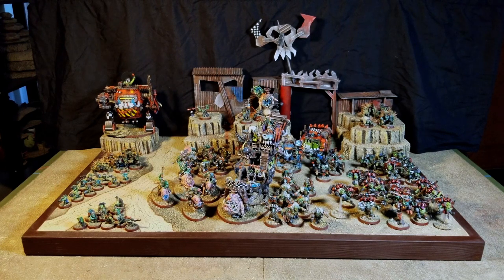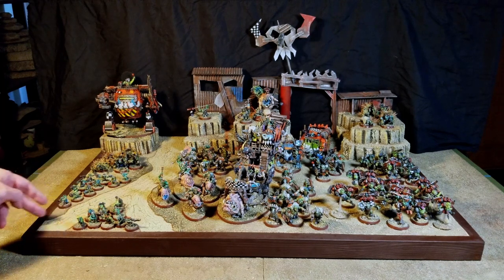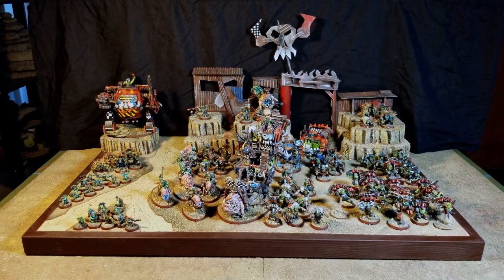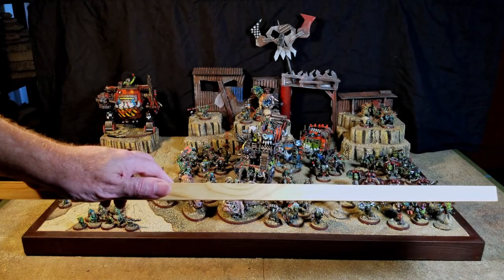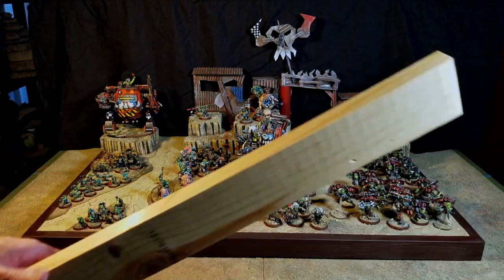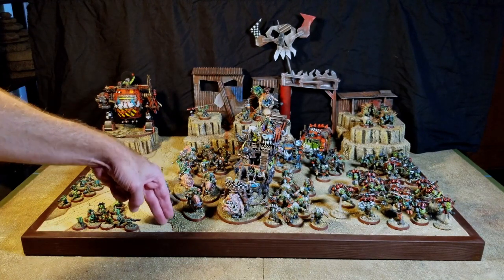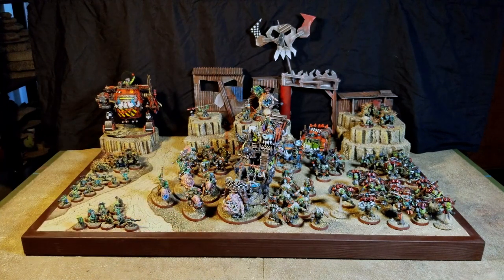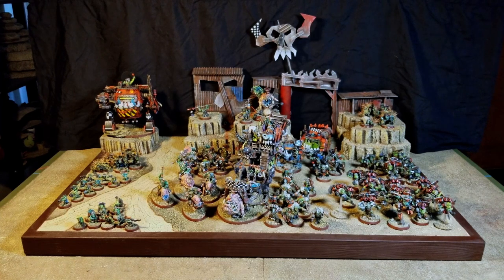Basically what this is, is a foam inner core framed by a one and a half inch pine. Let me give you an example — this is a three inch pine. You just go to Home Depot, pick up something like this, cut to size, nail it, and make your frame. Then you go ahead and glue or embed this foam. This is just styrofoam, regular foam insulation from Home Depot. That's also one and a half inch, so you got inch and a half here, inch and a half on the wood, so it matches up nicely and makes a good seam.